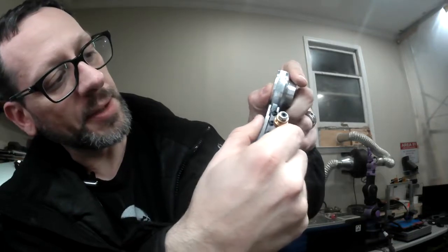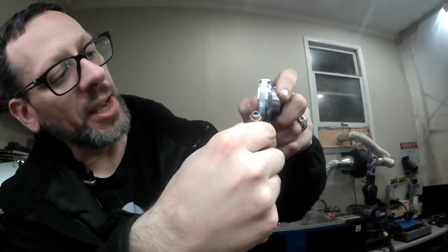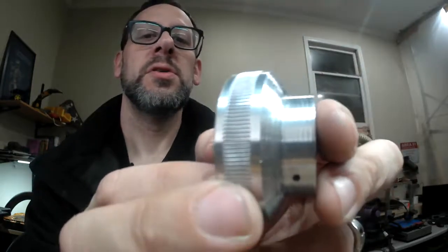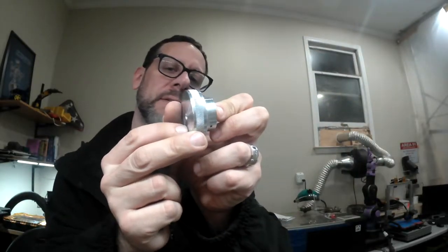The other tool that I used was this knurling tool that I got. This is about 20 bucks on Amazon, and it's just a steel wheel. It has sort of a triangular shaped line going across. What we do is we have the wheel come up against the circle, touch on it, apply pressure, get it spinning, and the wheel is going to leave its indentation. So I don't know if you can see that. It will kind of show some different angles and see how that comes out. But that's going to give me something to kind of get some texture on the edge of it.